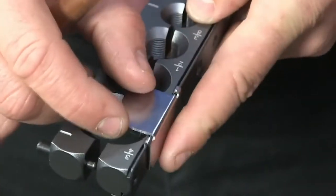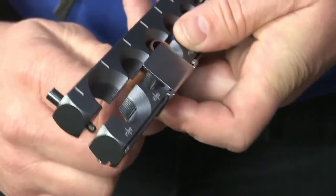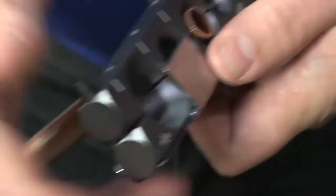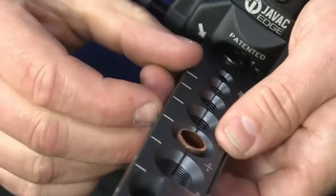This really assists anyone who wants to do a flare by guiding them to put in the right amount of copper tube through the flaring block to therefore get the perfect flare. So much so, anyone could use it — you could even get your apprentices to do a decent flare.